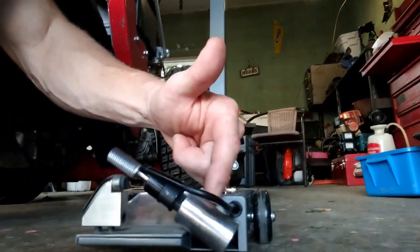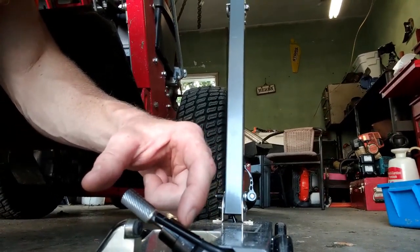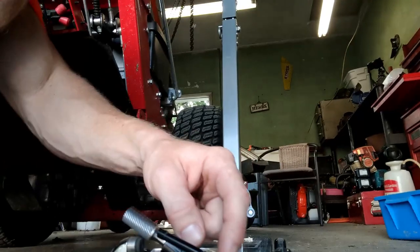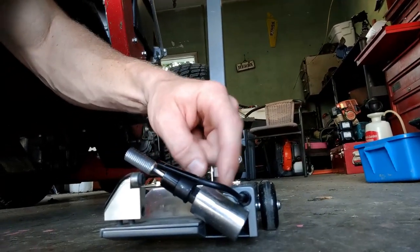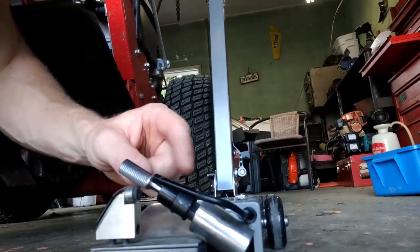Another thing happened that I had to consult the guys at Norcor about, although right as they sent me the solution, I had just got around to figuring it out. I sent them a short video right away. I could tell this was still spinning down in here, and it was spinning at first, but then it started coming out and lost the connection in here. This was spinning internally, but externally our bit was no longer spinning, and neither was the holder.